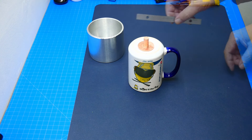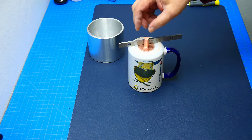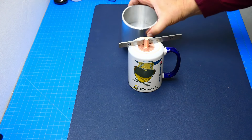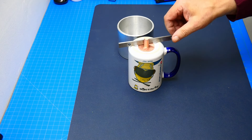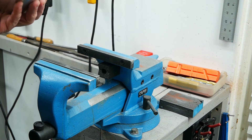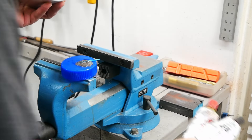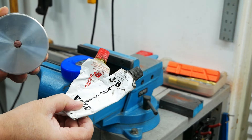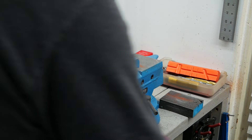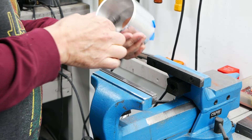If the cup sits on the aluminum there's a little gap, but it still makes closer contact than just sitting on the aluminum rim alone. This is the plan — press fit this in the vise and press it down. In the hole I added a little bit of epoxy — it is a press fit but I want to make sure it's 100%, so there's a little bit of JB Weld inside that hole. Here we are, pressed it all in with the center.